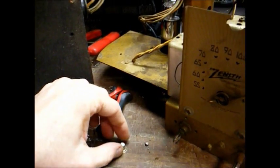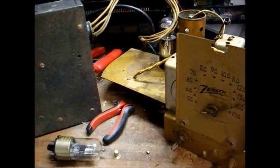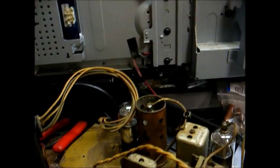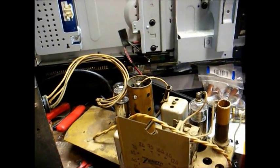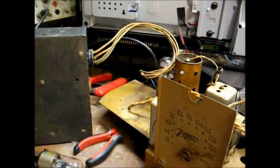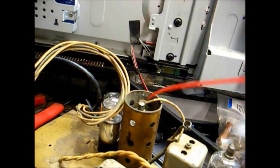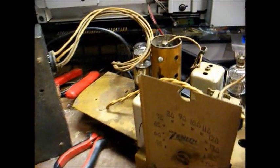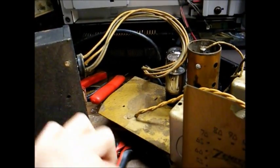After many decades, the glue that holds the tube grid cap in place becomes ineffective, and whenever you attempt to remove the connection from the radio from the tube, the whole cap just breaks off the tube. Sometimes you can minimize that effect by spraying a little contact cleaner around the connector, and that will make it easier to remove. But in some cases, no matter how careful you are, the top cap is going to break off of the tube.